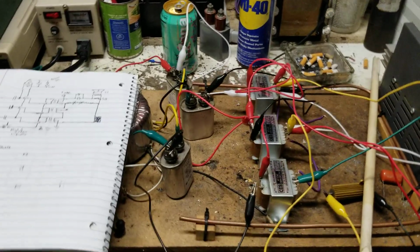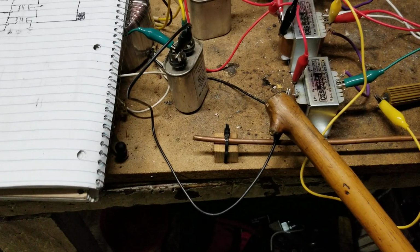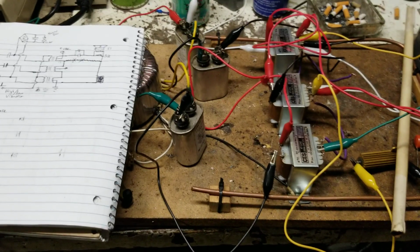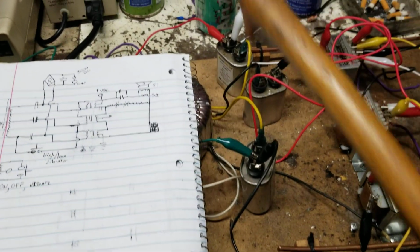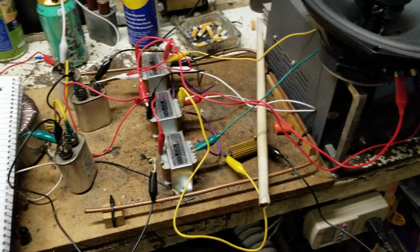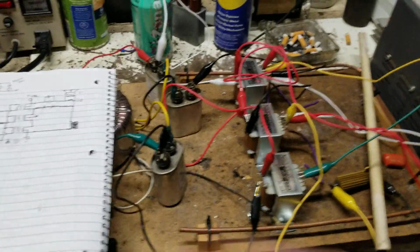And I can disturb it. I can make it in disharmony by messing with this diode here in series, or switching these around. I can get it to start misfiring like a blown spark plug or two, and those disturbances are reflected here because a massive surge of voltage happens at this output stage here that we can rectify, and that gets our voltage way up there. So the more I can keep it running in the disharmonic, misfire state,